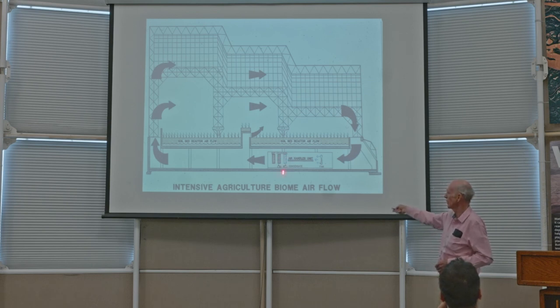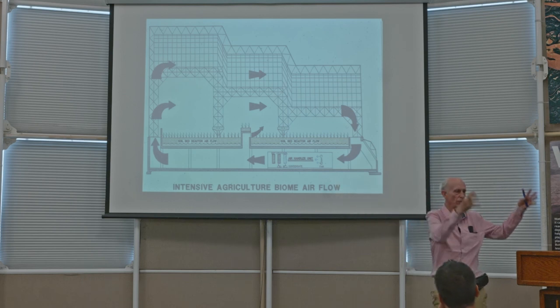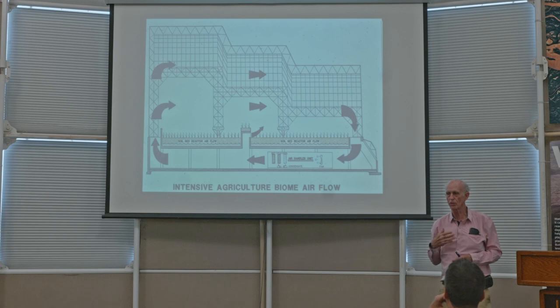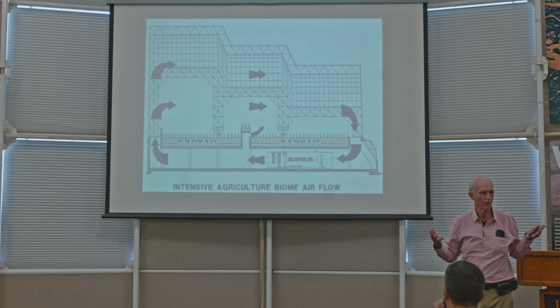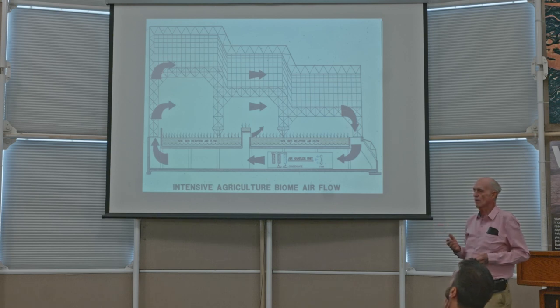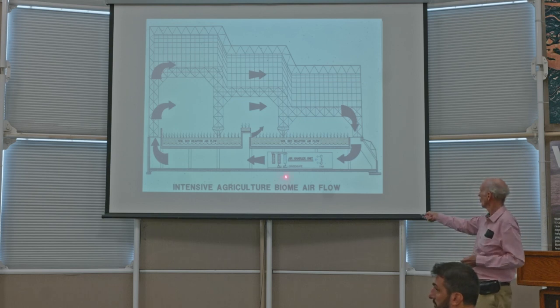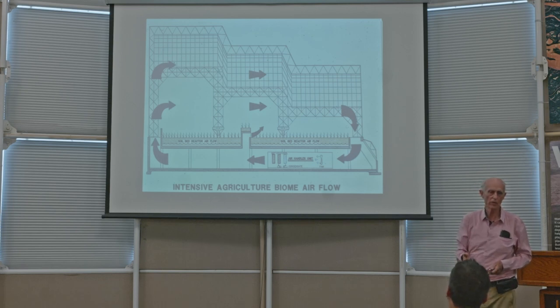So there's a cool coil, and most of you probably know that over at the energy center, there are these cooling towers, there's three of them. Well, that's evaporating water, and when you sweat, for example, you cool yourself because water is evaporating on your skin. That's one of the things that makes water cool. So there is direct circulation of that evaporated water to the first coil that we call tower water. And then there's chilled water, which is produced by a compressor, which makes it very cool, like 40 degrees Fahrenheit.